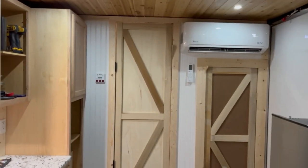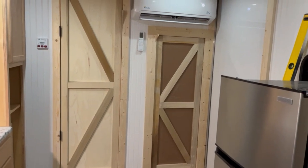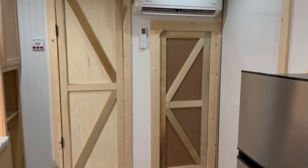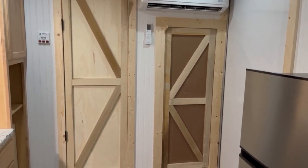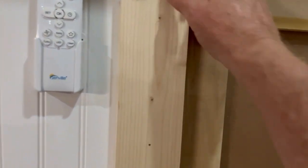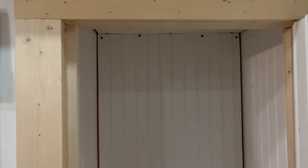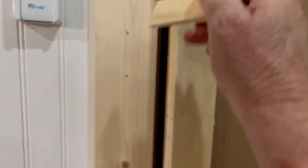I've built the bathroom door and the closet door. The center panel — the brown is actually the beadboard that I cut out of the hole and I just flipped it around, so it's masonite. From what I understand, priming it — which I will do — makes it very paintable, so let's hope it works that way. I put these together with a Kreg pocket tool. In the closet I've got all the corner trim to do yet, and I need to go behind that — that's where my black tank vent is. I've got to get that run; it's not run yet, don't want to forget that.